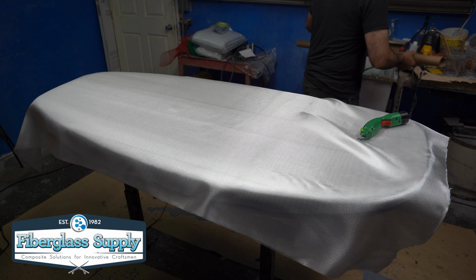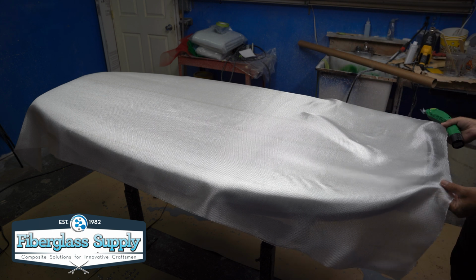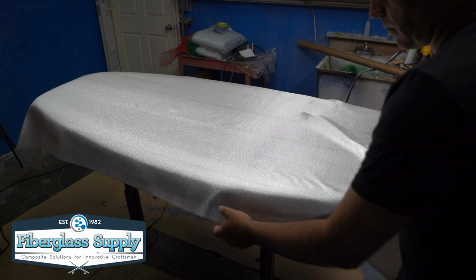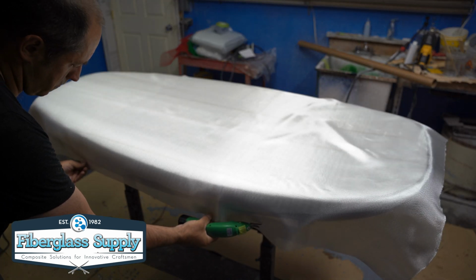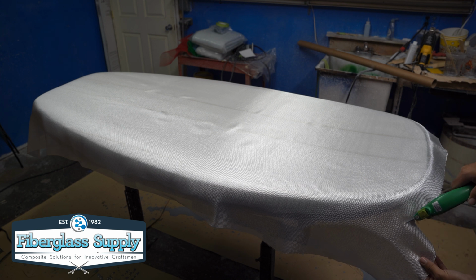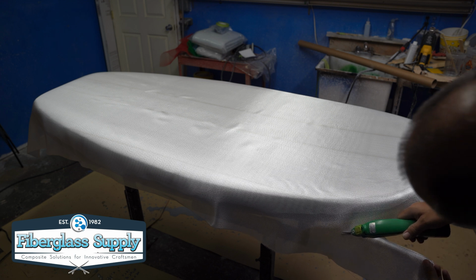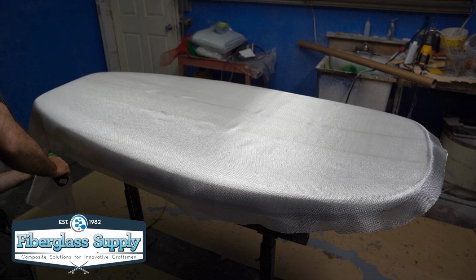that, if you prep it right, when you go to sand it, it's going to be a dream to sand. Super easy to work with, super easy to sand. And that's what you want. You want your preceding steps to build to the next steps and make them as easy as possible. Nobody wants to sand more than they have to. And epoxy is quite a bit more difficult to sand than polyester.